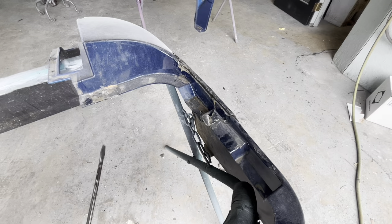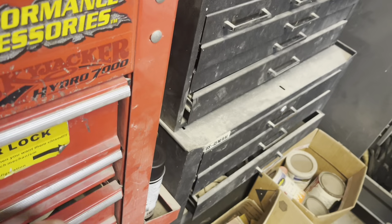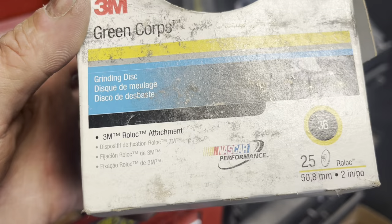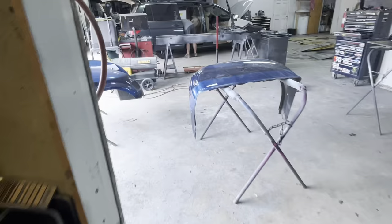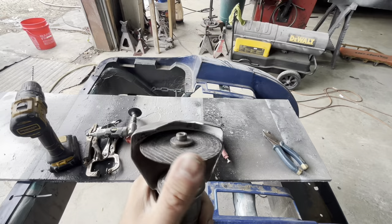I'm going to finish popping off what I can, then we're going to get our grinder and prep all these out. What we use primarily to prep this is a Harbor Freight 90-degree grinder with a grinding dish. The product is 3M, part number 01397 — 36 grit. They come in a box with multiple ones. If you're going to be doing race cars or anything, you really need to order one of these. We also made a cut with a 90-degree grinder with a cut-off wheel, making a long slit down the crack.